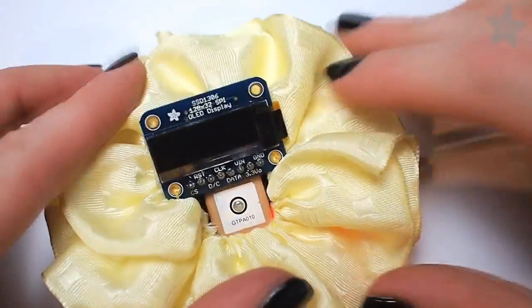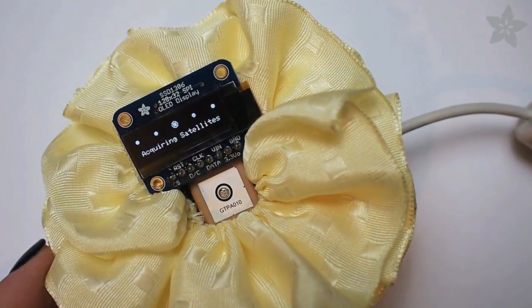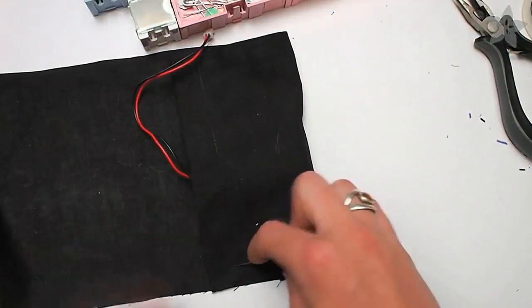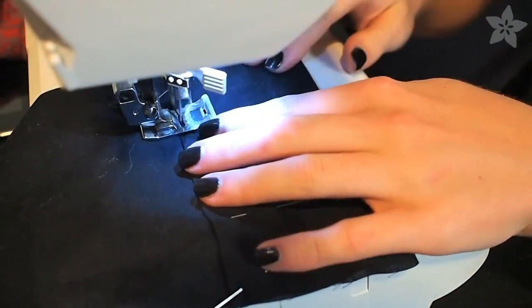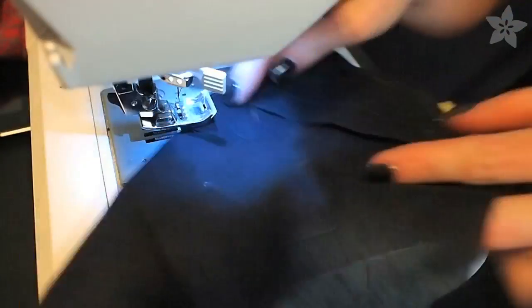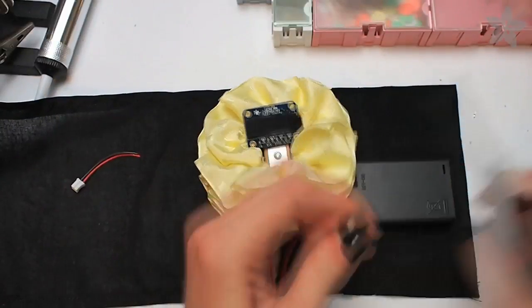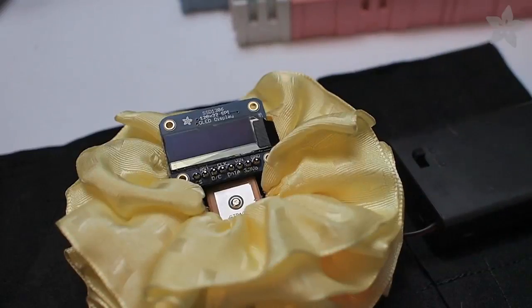Before worrying about batteries, I like to test the circuit on a trusted power source like a USB port or a benchtop power supply. Next, take a three AAA battery holder and a scrap of fabric, and pin and sew a pouch for the battery holder in the fabric. This scrap will wrap around the dog collar and hold both the batteries and the flower design to the collar. Connect the power and ground from the battery holder and solder those connections. Check to see that your circuit works before anchoring it to the fabric through the mounting holes on the 32U4 board.